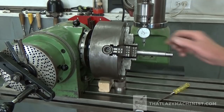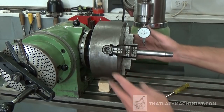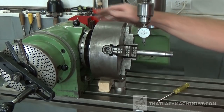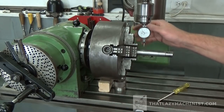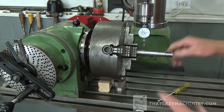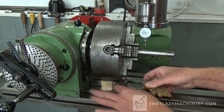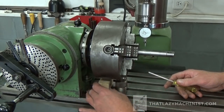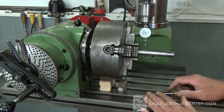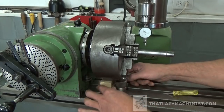I have a screw jack snugged up to the bottom of the four-jaw chuck to support it, because I've loosened the adjustment locking screws for the pivoting of the head, and when you do that this tends to want to fall — it's a very heavy four-jaw chuck. So before you loosen those screws, make sure you support it. I'm using a screw jack because I can adjust the height accurately by turning it to raise or lower. And I have a block of wood here as insurance — if something goes wrong and this falls, I don't want to get my fingers crushed.